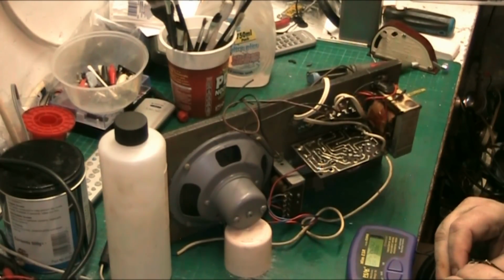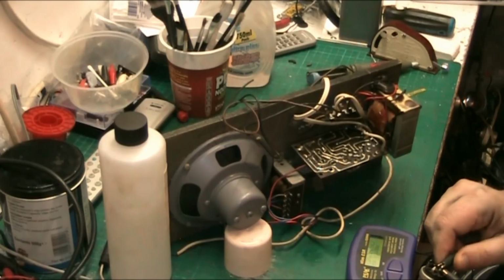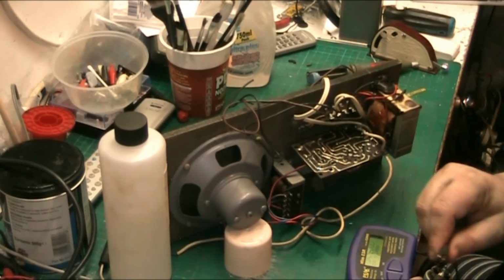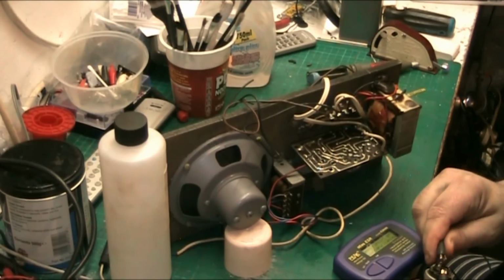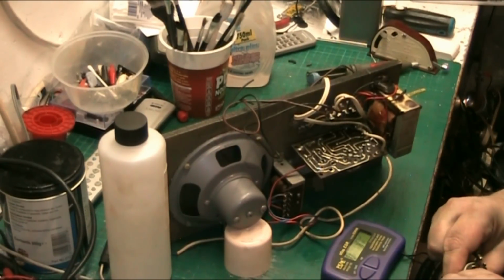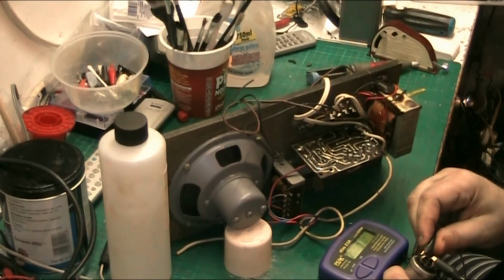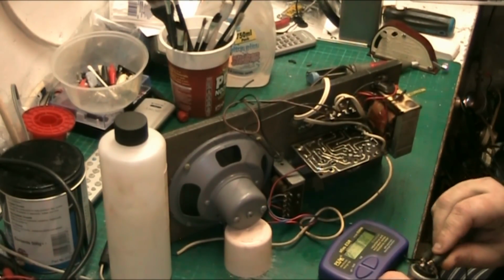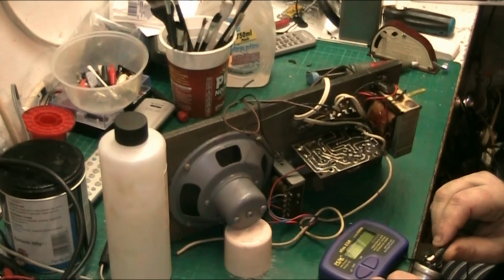And that's 44. So connecting them both up in parallel, which is what I've done. Now if I go to there, 21, go to there, nothing, there, it parallels them. So that one is, that's negative. That one's 43.2 microfarad. And that's 21. 43.